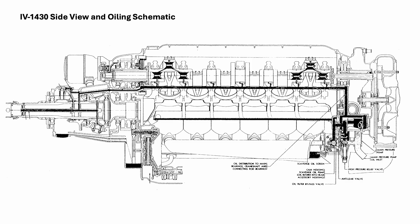The elongated shape of the engine was fully intentional, as it was designed to be buried inside the aircraft wings for greater aerodynamic efficiency. The rather unique propeller reduction gearbox can be seen in the nose at the left, and the single-speed, gear-driven, second-stage supercharger can be seen at the rear on the right.